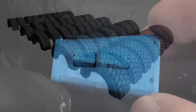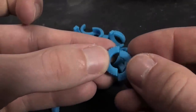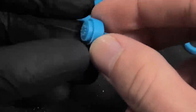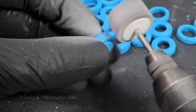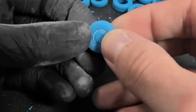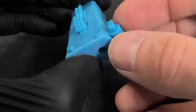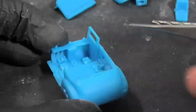I had a problem with printing the wheels. I cut them in halves in the editing program and print them without supports. The disadvantage is more cleaning, but the shape is precise and you reduce resin consumption. It is only essential to thin down the resin for correct fitting. The model has details like a separate clutch or shift lever.